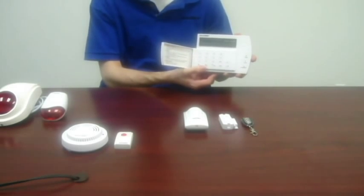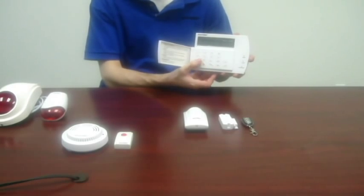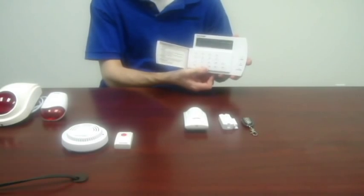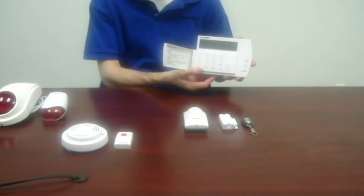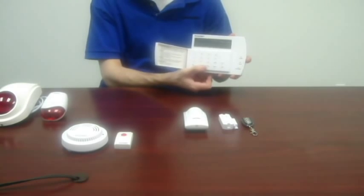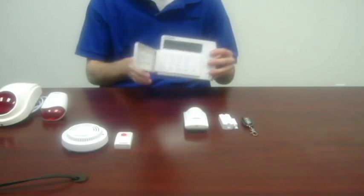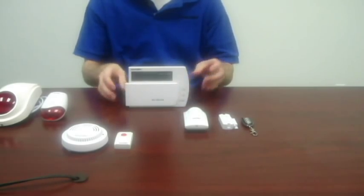If the number is out of the area code, press 1, area code, which is the 3 digits, and the phone number, the next 7 digits, such as 1-222-123-1234, followed by Enter. In case there's a second number that needs to be entered, press section number 02 and repeat the previous step. You may then press the Escape button to exit the settings, and your Air-Alarm1 system is ready to dial out.